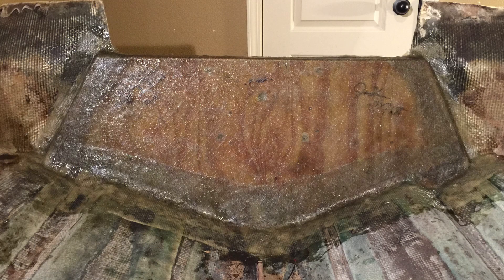With all that said, the transom is now skinned and tabbed into place. That was a lot of little prep work and little things just to do this, but I think it turned out just like I wanted. Now I can move on to cutting stringers, gluing stringers in place, and other deck support work. I've got some of my own updates I'm going to do on building the deck support as well as the bilge area — I'm going to modify from the original design a little bit.